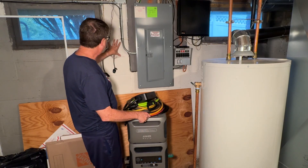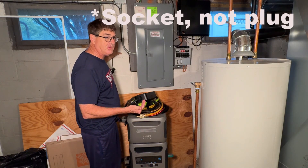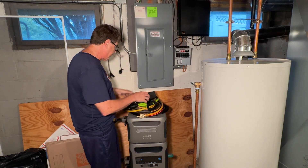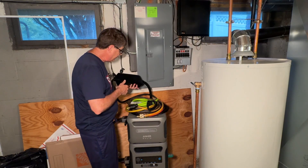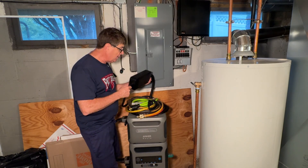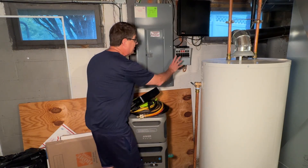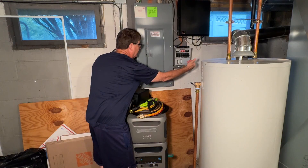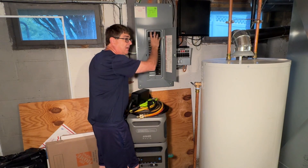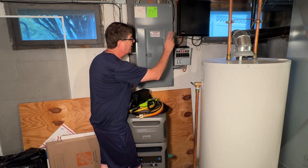So what we're going to do is put an inlet panel plug here — just think of it as an extension cord, so basically outside will appear inside. Then I've got the Anker pass-through charging device here, this cord, and that will connect to this new box and then into this panel. Then this is going to go away. We're going to put a new inlet here that's going to feed the panel coming in on this 30-amp breaker. There'll be an interlock here to keep it safe — this is all up to code.